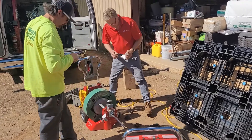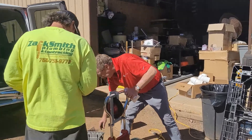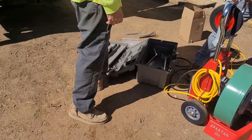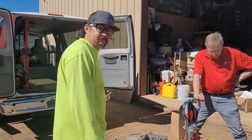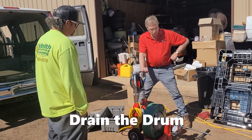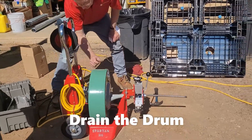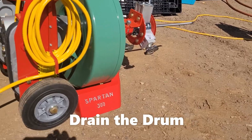You're dealing with a little bit more power here, running a little bit faster, so be more attentive to what's going on. We don't do that many — a few little jobs. Some of these jobs you're going to pick up water in the drum. You definitely want to make sure you drain that one — that's a steel drum, this is an aluminum drum. If you look right here, you pull this down to the bottom to drain any water you've got in there.